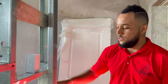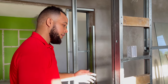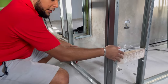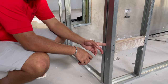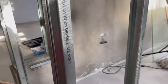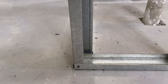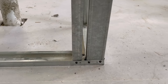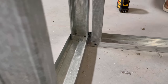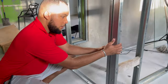The more complicated part is when you're dealing with the corners. I've seen different drywall persons install the corners differently. One of the recommended ways is when you're turning the wall, you want to leave a space for the drywall to fit in between it. What will happen is that the drywall, instead of stopping at the edge, would come right through to the back of the wall. We left half an inch space so that once the drywall comes in here, it would clamp it and ensure that it is extremely solid. This also ensures overlapping — you put drywall on one wall and that drywall would run around the corner too. It's recommended to have this overlap to ensure the corner is as solid as possible.